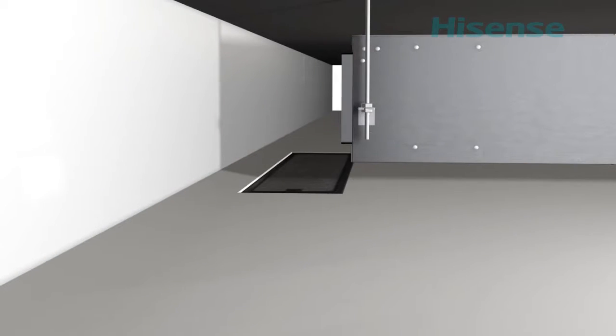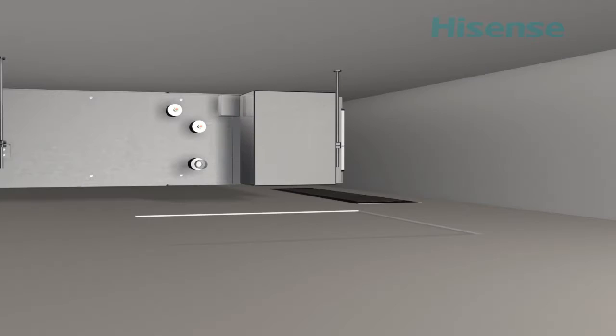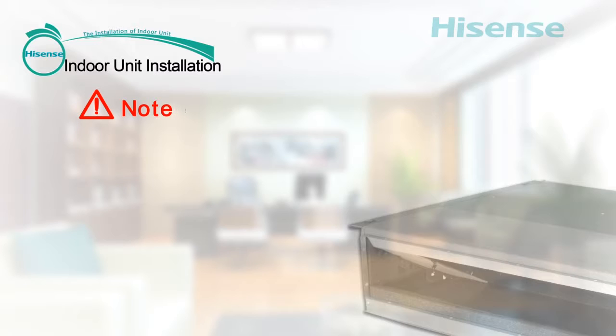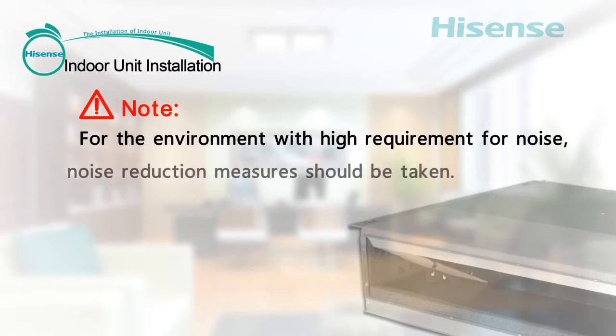Using a local ceiling, air inlet is at the back of unit. The distance between indoor unit and the back wall should be at least 200 millimeters to keep the enough air return space. Service hole. Install ceiling with a 450 by 450 millimeter service space at the position of electrical box. Note: for the environment with high requirement for noise reduction measures should be taken.